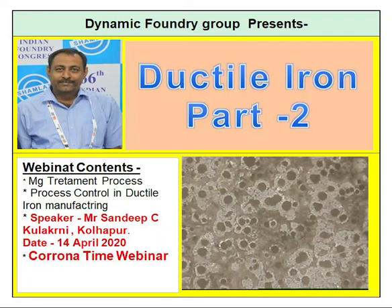So we are talking about metal inspection. At around 80% of charging, you can take the sample. First, we can take the ferrolab sample, then the spectro sample. As I told you, carbon in ferrolab is more consistent than spectro, but you can validate it at the initial stage of the shift, and then you can continue with the spectrometer as well.